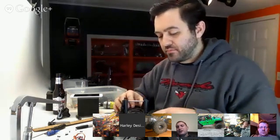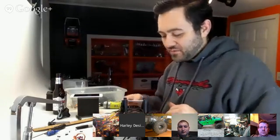Which I think is funny. I mean, because when you're welding, like you were showing your TIG videos, you were welding at like 30. Right, 30 amps. Well, and 30 amps DC. Right. Because I'm running DC only on that. It's not an AC welder. But yeah, I don't know what the volts is though. So if I'm at 10 amps but 300 volts, that is a lot more power than. Right. So yeah, there's a lot of variables there to definitely work through.